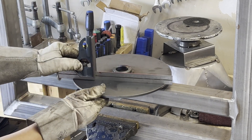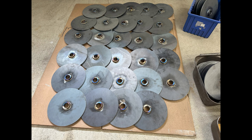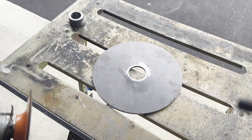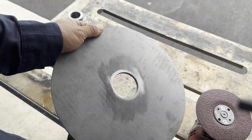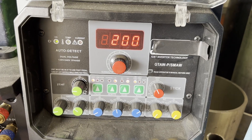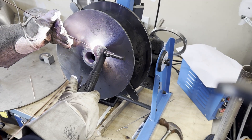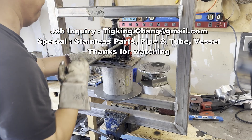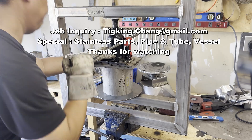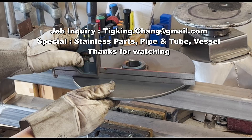I think it is good enough. All done and ready to deliver. It is a very simple episode, but please remember the key points: remove the mill scale before welding mild steel; set the weld current high and travel fast to give less heat input; and weld heat pulls the material, so you should know how to straighten it by heat or press. Thanks for watching, and see you next time.